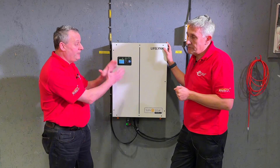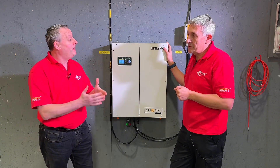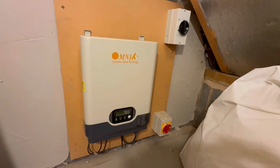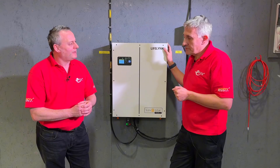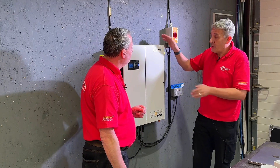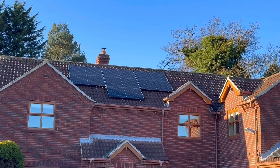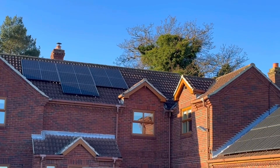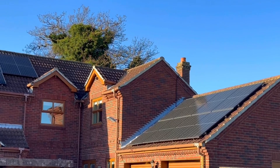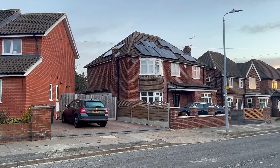Because it's so economically priced, that would be a quick solution. But what we could find is that maybe they've realized a little bit more storage would be greatly beneficial. Is it easy to add additional batteries? Yes — there are two options. Either you can parallel multiple units of the complete combination — so the inverter and battery. Imagine a complex roof geometry where you wanted multiple strings; you could have one of these on each string and share the battery capacity between them. If you had four of these in, you'd end up with eight kilowatts of storage.